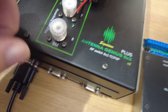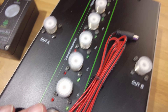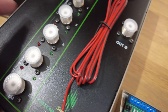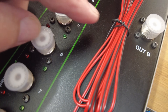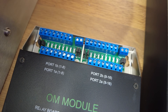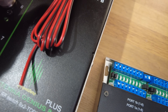We'll end up with seven here and six on this one — so 13 antennas in total. However, if the left-hand radio wants this antenna and this antenna, then the right radio will only be able to select any of the others — 160 meter, 80 meters, and so on. Like the 80/160 vertical, there'll be a fly-out: do you want 80 or 160? Selecting 160 will fire a relay to the bottom of the 18-meter element, fire a coil, and give us 160.